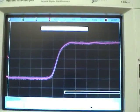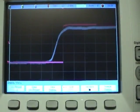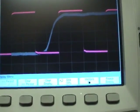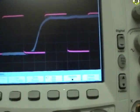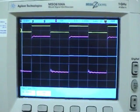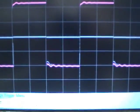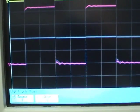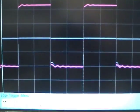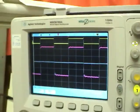Print that and zoom out. Now that does look different. There's no little oscillations there, so something's different between these still, though. I'll have to look into that. Actually, come to think of it, I remember vaguely seeing a distortion like this before when I was using one of these probes, so it's not impossible that this is a quirk with this design or with this older probe.